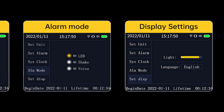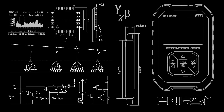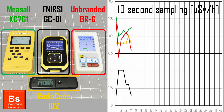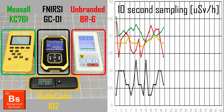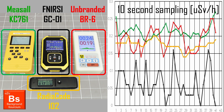Right, let's get on and test this sucker. The first test of any detector is to make a measurement of background radiation — and counterintuitively, this is one of the most difficult tests, particularly for a low-cost counter. I am going to measure and record the levels from the FixCo device and also from some of my other detectors and then graph the results. In this graph, each point represents a 10-second average. For the two scintillation detectors, there is less measurement noise, as would be expected with devices with much higher sensitivity — they are just able to deliver a better average due to the higher number of events counted per unit of time. What is clear here is that there is a serious sensitivity issue with this product. When looking at the overall average, it is reading about one-third the value of my other detectors.